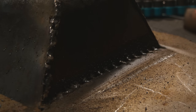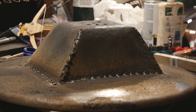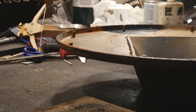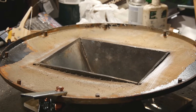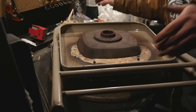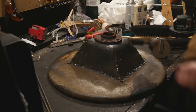I'm having a lot more success just kind of stitching it together. I've never been a good welder — I think if I wanted to actually improve I'd have to take a class. Just for the purposes of building this thing, the stitching method is probably the best I can do, especially on this sizable gap. In an effort to save some embarrassment I could have gotten the angle grinder out with a flap disc and cleaned this all up, but you're never gonna see the other side of this thing anyway. I'm gonna go around the inside and do the stitching there too. I'm gonna be cannibalizing my old forge to make up for the cost of that welder.